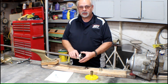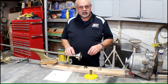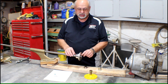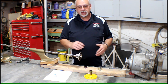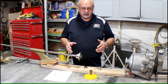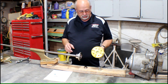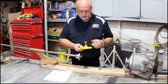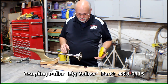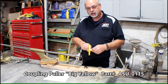Now to remove the coupling, you have a couple different choices on a conventional direct drive inboard like this setup. You can put a spacer or socket between the coupling halves, get some longer bolts, and compress that off — that's the old school cheap way to do it and it works just as well. You can also buy our coupling removal tool which is pre-drilled for all three of the coupling sizes. It simply bolts on and the push bolt will push the coupling off.